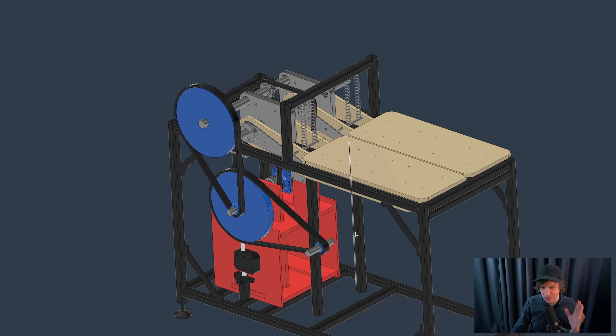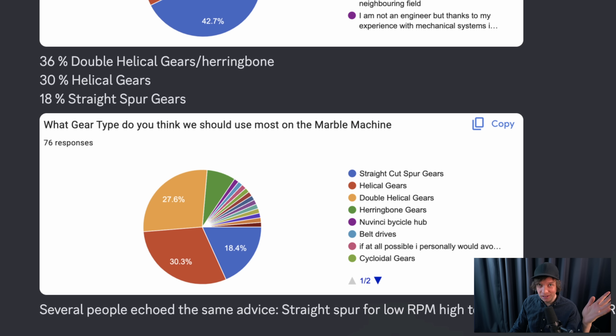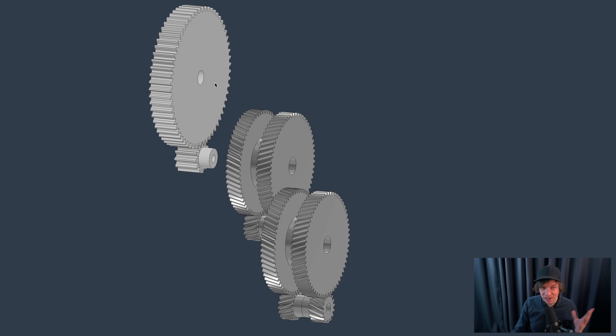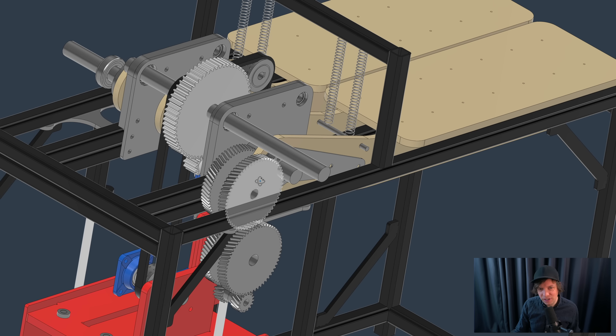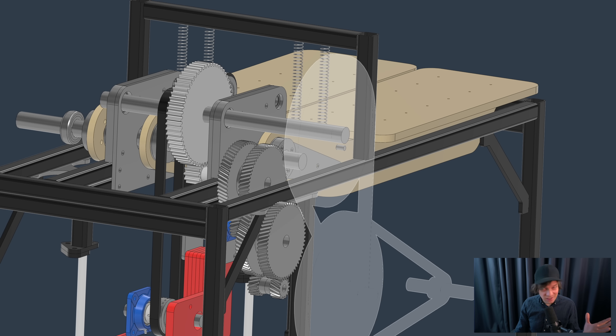There's no magic bullet answer to this question. I sent out a help request for choosing the best gear type, and the responses were super interesting. 66% thought that some kind of helical gear is a great choice. The community also helped me create a list with gear suppliers - we want to use standard parts. But another type of feedback really resonated with me: these kinds of gears need high precision. You really need the shafts to be at the correct distance from each other and completely parallel. The tooth interaction, especially with helical gears, needs to be perfect to achieve those high 98-99% efficiency numbers.